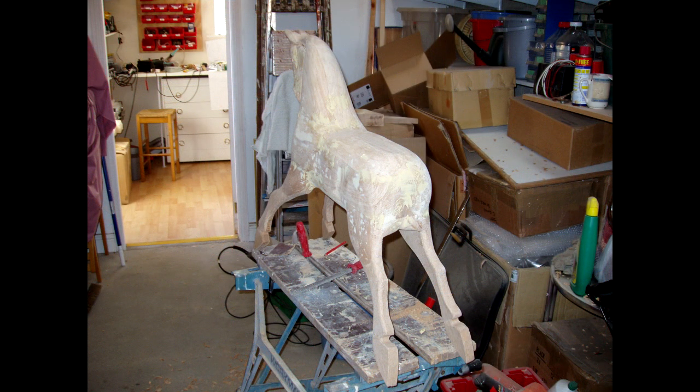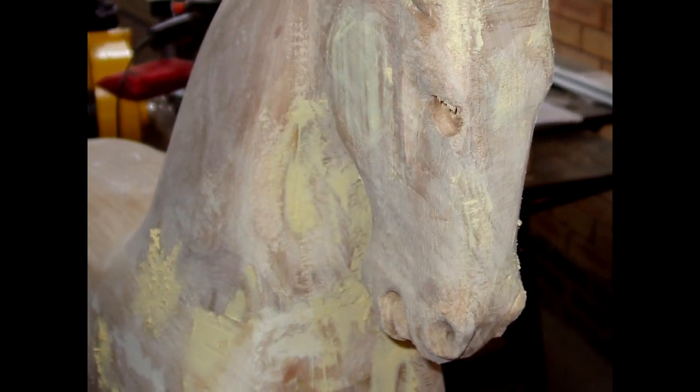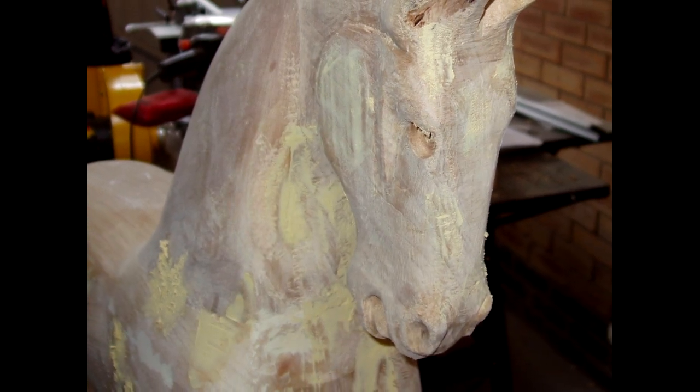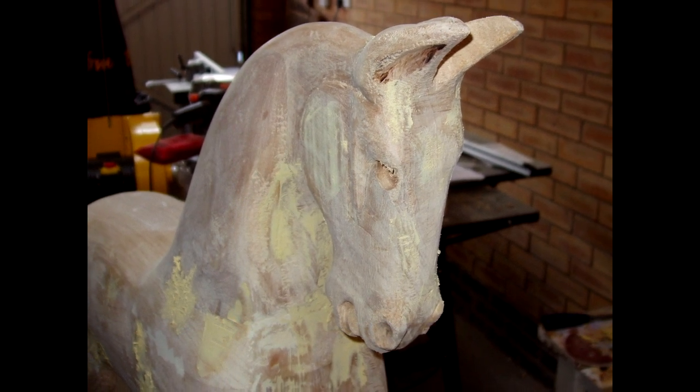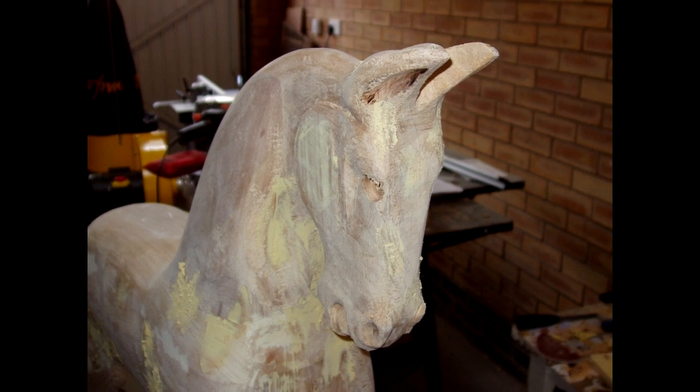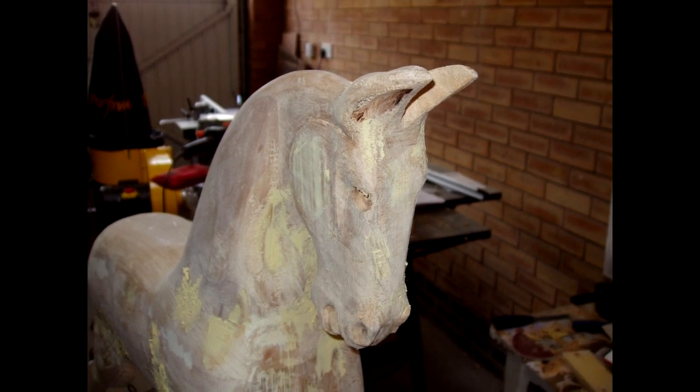There's a lot of carving needed to create the smooth contours of the horse's body from the square blocks of timber. A file-type surform and a rasp are useful tools to have on hand. Ordinary files can work, but they tend to cut rather too finely, although for ultimate finishing they might have their uses. I preferred to use grades of abrasive paper working from rough to smooth.